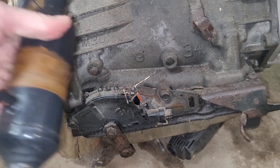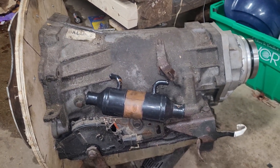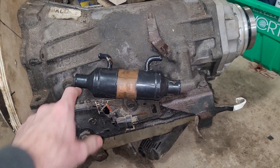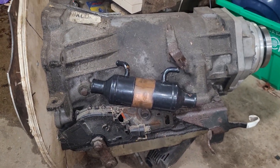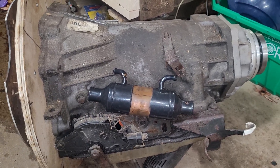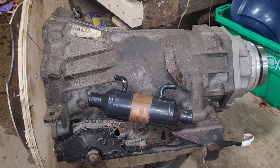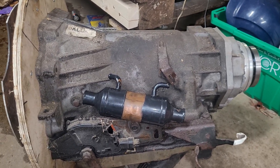Lines will go up and over the transmission to the transmission ports, and then the raw water pump discharge from the engine will probably go through there to keep the transmission at around 180 to 195 degrees. We'll see how hot she gets when she runs.